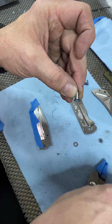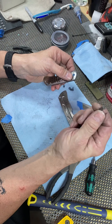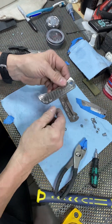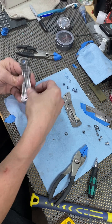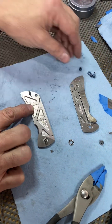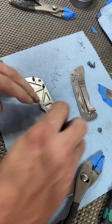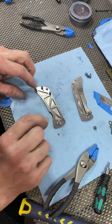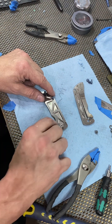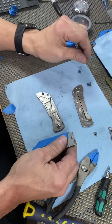Then screw this one in not all the way but almost - leave a tiny little gap. That goes through the show side. On the standard pivots that are integral, they also always go through the show side, so the screw is always on the lock side when we send them out. Take your two frame screws, pop them in, lay it down, two standoffs - or if you buy one of our back spacers, just set your back spacer on there. Stop pin, bearings - it makes zero difference, but we always put the bearings with the closed side of the cage towards the blade.